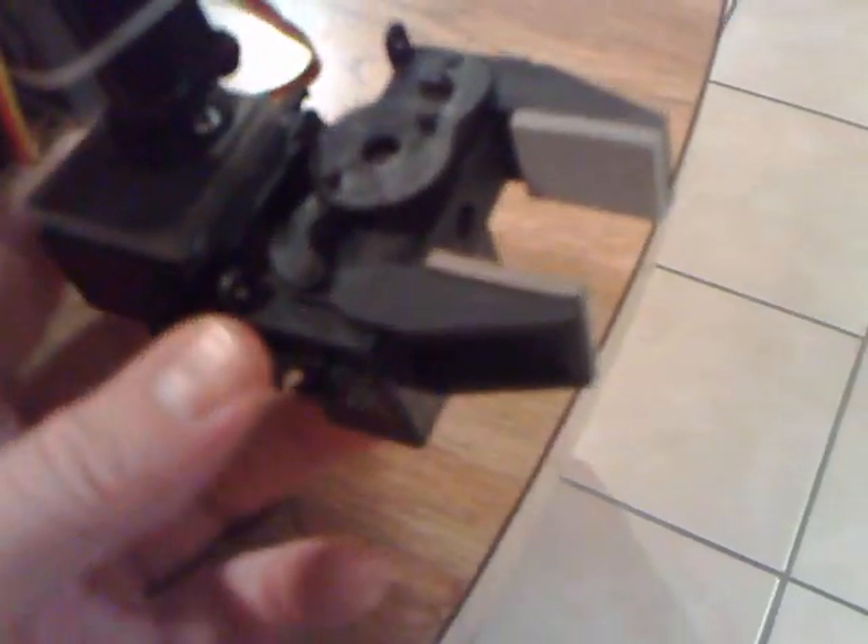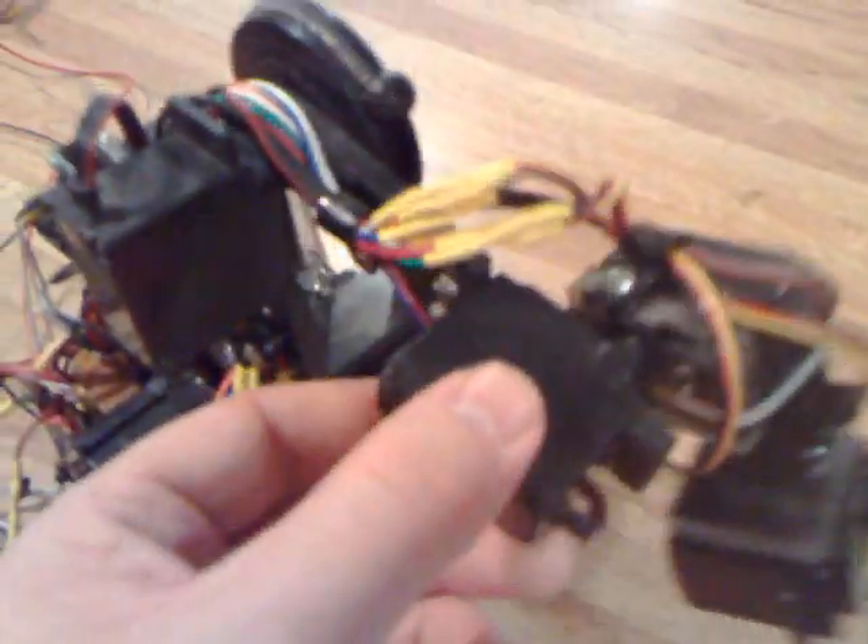The components of the six-axis arm: there's this gripper from eBay, and some servos also sourced cheaply. They're bolted onto plexiglass bases and super sticky double-sided taped onto the servos — been sitting there for eight years, so it's pretty strong. Each joint is like that. This is the double wrist joint here, and of course the elbow counterbalance with a spring to help out. The shoulder has two servos working together, and for the roundhouse there's a bearing box with a shaft that stays stationary while the servo turns itself around it.